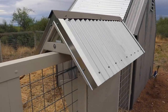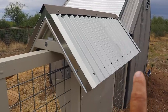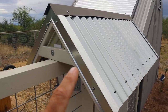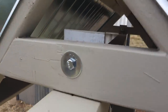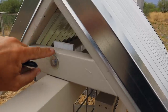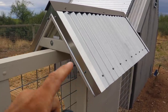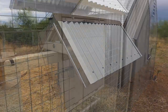Starting from the top down, the roofing structure that provides rain coverage for the feed below is approximately 50 inches long. Each of the structural members that extends out on either side is 21 inches long, with the roofing extending an additional inch and a half. This little piece right here is about 13 inches end to end. I've secured the whole structure to the fence with some homemade brackets made from steel angle, bolted in place. The roof and trim use standard roofing screws and flashing on the ends for a clean look.